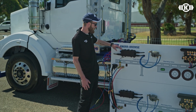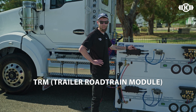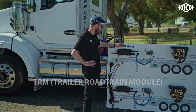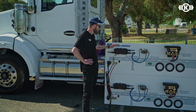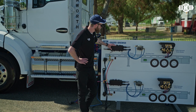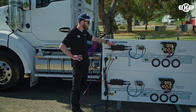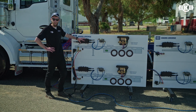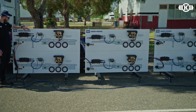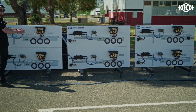Today we're going to discuss a TRM product and what applications and benefits you'd see it being fitted and used in. TRM stands for Trailer Road Train Module. Its primary design was to be fitted to any towing trailer to be able to split the power and the CAN communication from the front coupling through to the local TEBs and then out the back to the rear coupling.